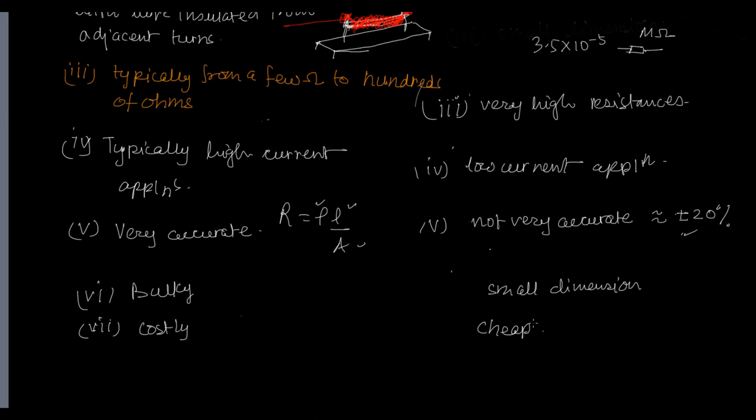It seems like a very picture-perfect setting — very cheap, very small, can be produced in bulk, and even very high resistances can be manufactured. To achieve high resistance, either you increase the length or you decrease the cross-section. Typically for high resistance we try to squeeze the cross-section rather than increase the length, because there is a limitation on how long a resistor can be if you need to fit it in a printed circuit board and solder it.